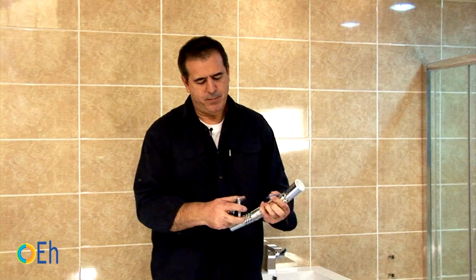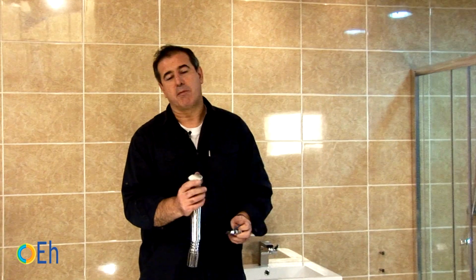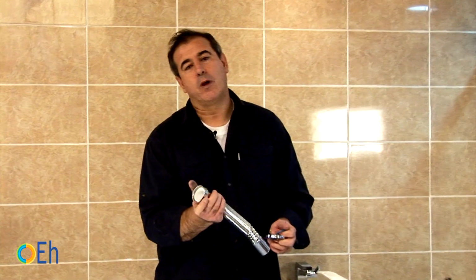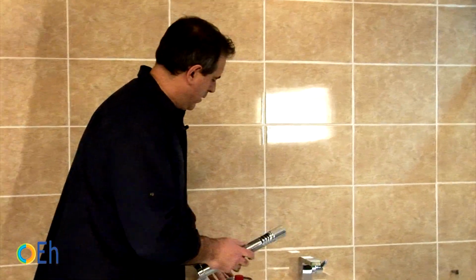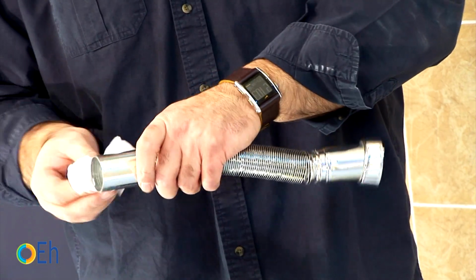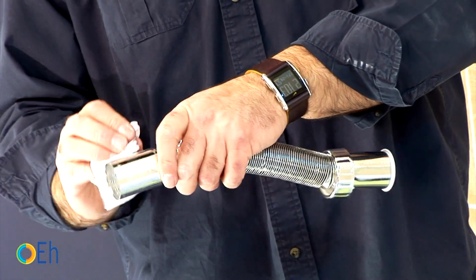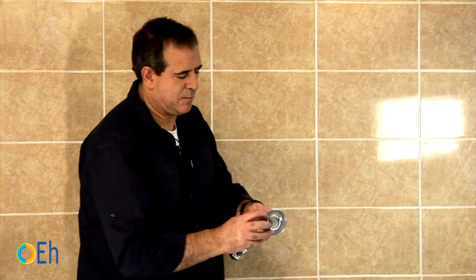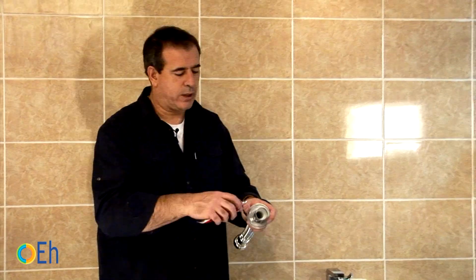But before you put it, we will always pass the gasket with a thread, which will allow us to tighten it directly to the bathtub, as it will be placed directly inside the drain. What we have to do is always apply a PVC glue to it so that it is perfectly glued. When we glue PVC, you know that the first thing is to clean it with a special PVC pipe cleaner, or another solution is to sand it a little bit. Let's first pass the trim and apply some adhesive on the entire surface.